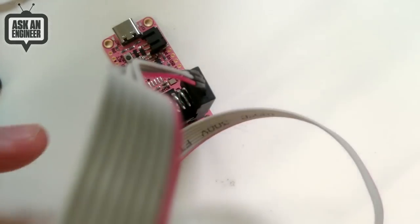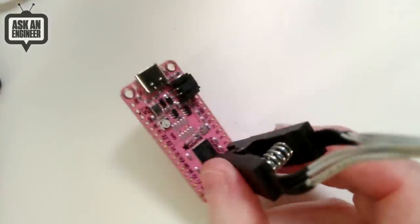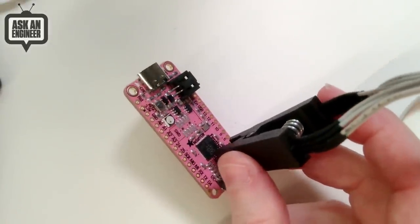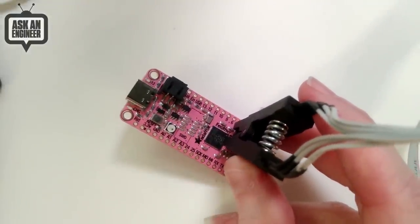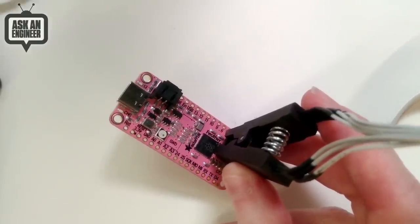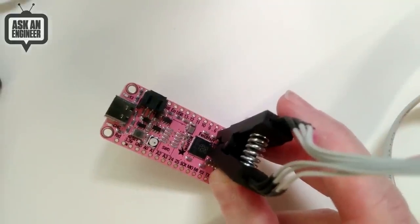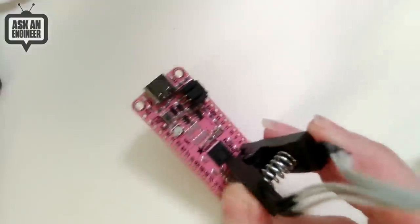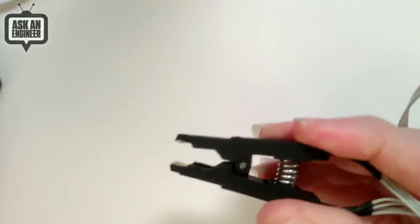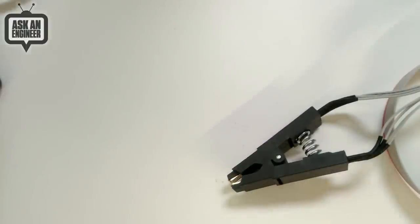What is this good for? First off, debugging your QSPI connection on your RP2040 — I had to do that three times. It's also good if you want to program EEPROMs that are on a motherboard; you clip this on and program them without desoldering the chip. You can dump firmware from an SPI chip that holds firmware for your FPGA or whatever. All that and more with this handy dandy SOIC-to-DIP clip. It's got little dragon teeth — don't put it on your body, use it for SOIC clips only.